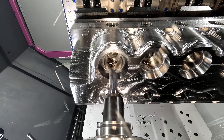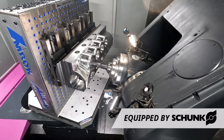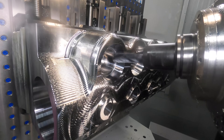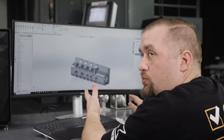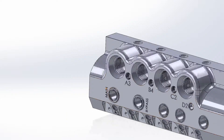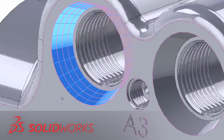You can see we have full five axis synchronous motion — the C-axis and tombstone are rotating and the head is tilting up and down. When doing swarf machining it's important that you have an actual ruled surface. We can come into Solidworks and throw some face curves on that surface, and you can see right away that it is ruled.